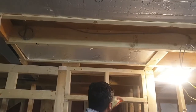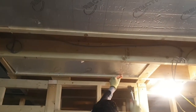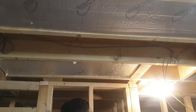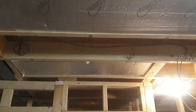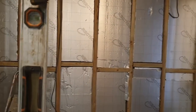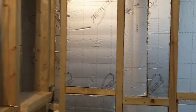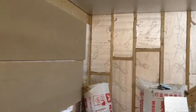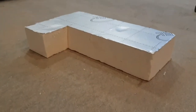Where it's slightly looser than we'd like, you just need to apply a nail to make sure it's not going to come down. There will be another board fitted underneath and then the plasterboard will be applied as well, so there's no chance of it falling off - the nail just adds extra security. We've now completed all of the insulation for the loft area. Scanning around this room, you'll see that all of the vertical timbers - previously there was a big hollow gap between them - have all been filled by the 100mm thick insulation, cut to size and pushed in between all of the individual timbers.